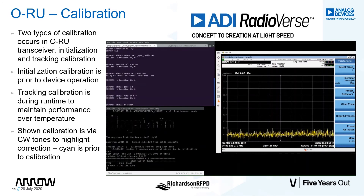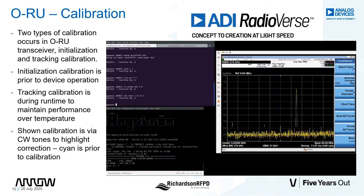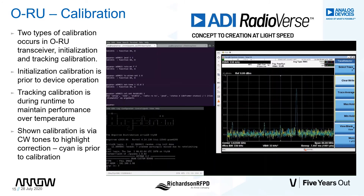A positive 12 MHz CW tone from the LO will be set up on the transmit path. On the spectrum analyzer, you can see the tone pop up. Let's go over the tones from left to right. The leftmost tone is the HD3 from the positive 12 MHz tone. Next is the image. Centered on the analyzer is the LO. And finally, the rightmost tone is the actual positive 12 MHz tone.